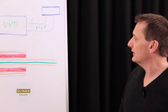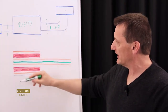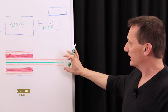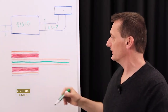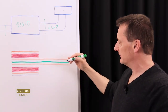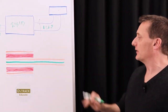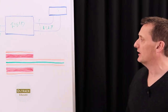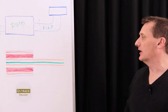Now I'll talk about the stack-up in general. We have this one board that consists of rigid and flex. On the left I have the stack-up applicable for the rigid section, and then going through the middle continuously is the flexible section. So I end up with two stack-ups. The fabricator will use this stack-up for all rigid portions, and the stack-up on the right for all flex sections. That's how the construction will be. The flex layers actually cover into the rigid section, so they're combined. There are many more configurations you can use — this is just a simple four-layer example — but for however many layers you have, you always want to try to keep the flexible section symmetrically in the center as a common guideline.